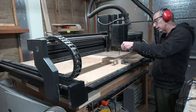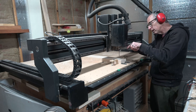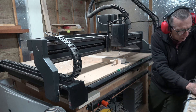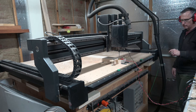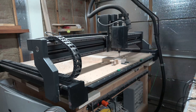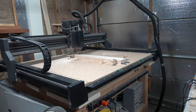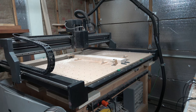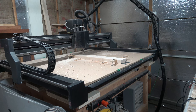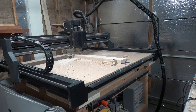The carving operation on the back of the guitar neck is going to require a longer reach bit. So I'm going to be using a two-flute spiral up-cut bit — it's a quarter inch in diameter, but it has a cutting length of about two inches, and that's plenty to cut through this one and a half inch thick blank. Since I'm swapping bits, I've got to probe the bit again to get the z-axis position correct. Then I'm ready to start carving the back, and this is actually going to involve a two-pass cutting operation. The first pass is a rough cut that's going to hog out most of the wood, just like I did on the front of the headstock face — but this is going to be the entire back of the neck including the heel as well as the headstock and the shaft in between.